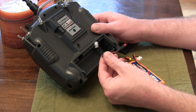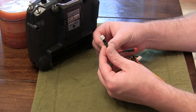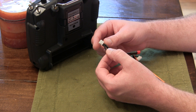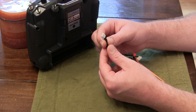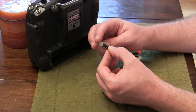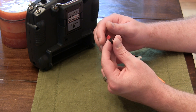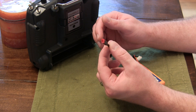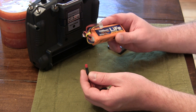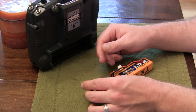What I did was I took a balance charger plug off of a two cell LiPo I had that was old. You can also use a servo connector, like from one of my old HXT 900 servos. Then you'll run the wires and put a JST plug — I just put some heat shrink over here — which plugs into most LiPo and LiFe batteries. Whatever connector you can fit inside the compartment would be fine.